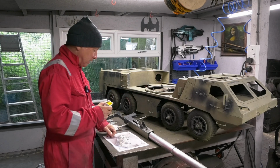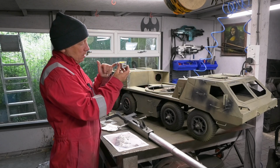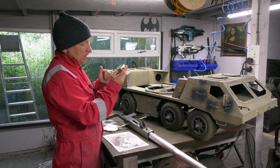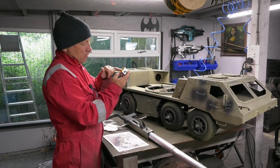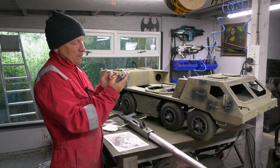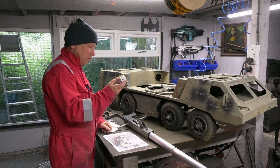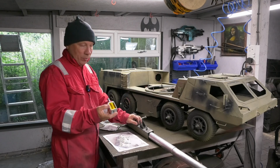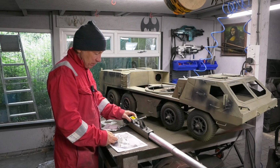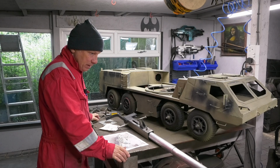And that is a bit of a pain. It's not that it can't move it. The problem with all of these solenoids is they can't have any initial resistance. Any initial resistance will stop the electromagnet engaging properly. This one in particular looks chunky, but it's not quite doing what I want it to do, and I can't really find one that's more powerful. So I'm back to the drawing board a little bit on the recoil. The idea simply was to mount this on here and then do the recoil, but yeah, bit of a pain really.